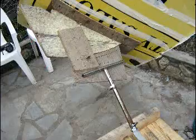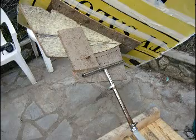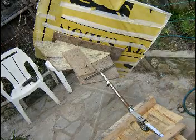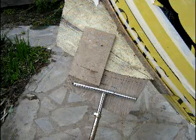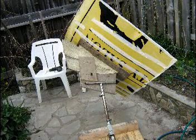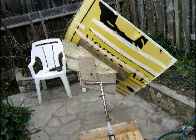So there you go, this is it. Here are a few pictures of the equatorial mount. It's a pretty unusual one I made because of what I had — my scrap material. The arc of the circle is centered on the focus of the parabola, and that's one of the keys to it.